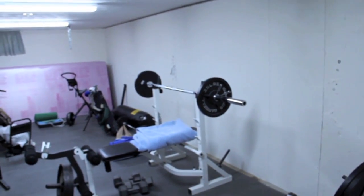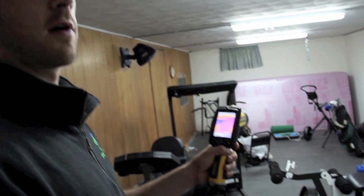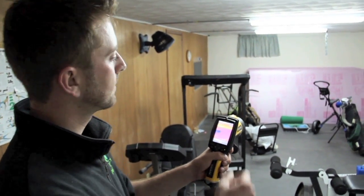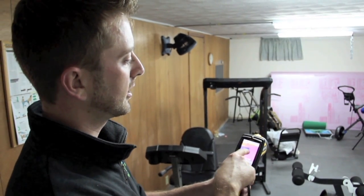Same thing where the electrical line goes through the attic. Foundation walls actually have very little R-value — eight to ten inches of concrete only has an R-value of about one. To put that in perspective, single-pane glass windows have a higher R-value than ten inches of concrete. Right here you can see the darker color is what is actually above grade outside, and that's the coldest surface area.